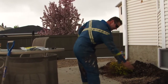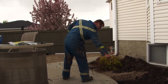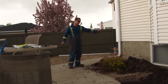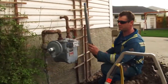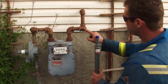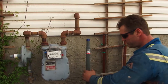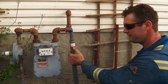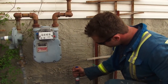We had a hand dig starting here because of our Alberta One locate. It begins here, comes right around the corner and back around to the gas heater. Here we are at the meter — this is the riser we're going to be installing. It's got a 3/4-inch gas line; we'll be tying in right here, putting in a tee, and this riser will be connected with a swing joint. The little red mark on the riser indicates the maximum buried depth, so we want it sticking out of the ground roughly to this height.